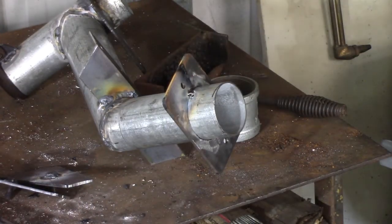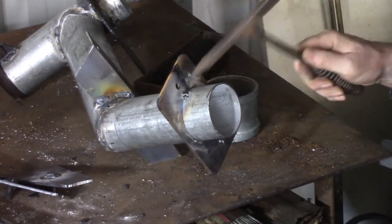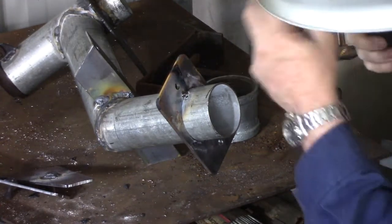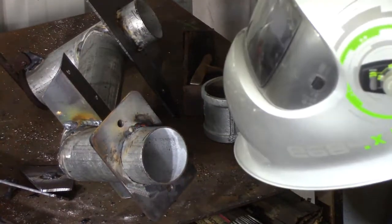Since I'm welding gal, I'll get this fan on. Also, it won't hurt to have the fan on because in spite of the fact that it's early spring, it's getting damn hot in here. I keep going pretty quickly so I don't burn through this pipe. Too quick. That was more like it.